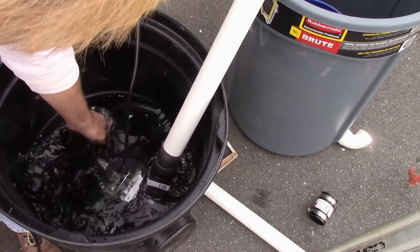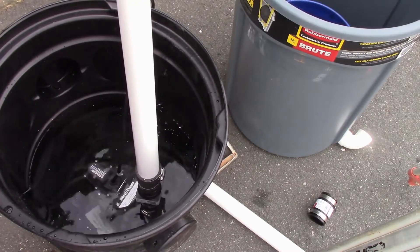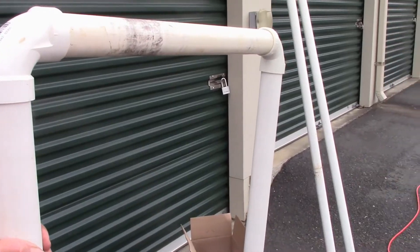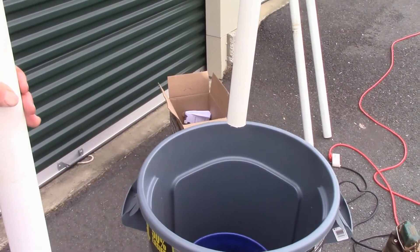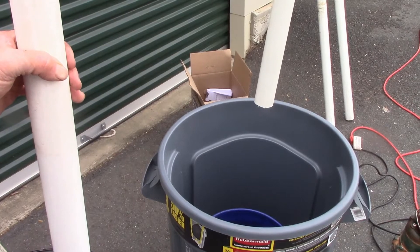You can see I've set our pump down here in the water, and it's ready to turn on as soon as we plug it in. We're going to plumb it up four and a half feet, and it's going to discharge over here into the five-gallon bucket below. We'll time that and see how many gallons per minute this thing actually pumps.